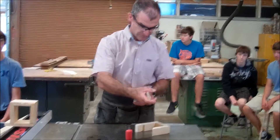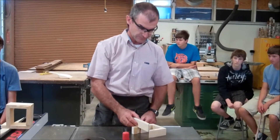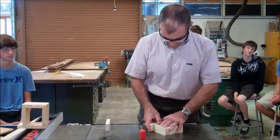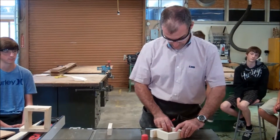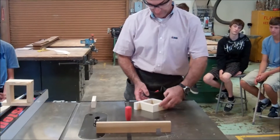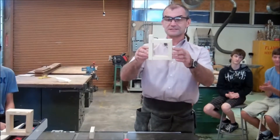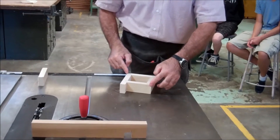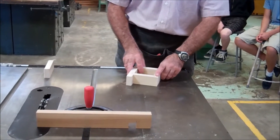I've got to make sure I get my miter right — my miter's going out that way. I sketch it on there; this is the exact mark, that's the rough side. This off-cut is my other miter. There's my butt joint — I'm going to cut this one so that it drops right in there. And then the check is you want to go corner to corner, corner to corner. If those are the same, that means it has to be square.